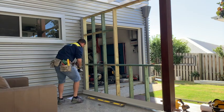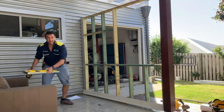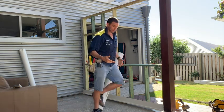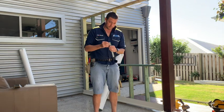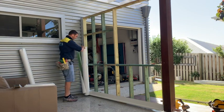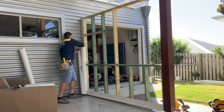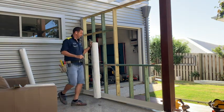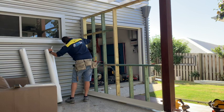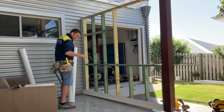I've got one more to put in. There we go. Next step is sarking. I've pre-cut my sarking and I'm going to run this out of the wall over here using a hammer and some clouts. I've got my clouts — I'm going to roll those clouts up so I don't stab myself. We don't want this to sit hard down on the very bottom. I want to sit this up about 20mm. So I'm going to mark on my wall a line and put a mark approximately 20 to 30mm above that — and that's where I'm going to run my sarking.